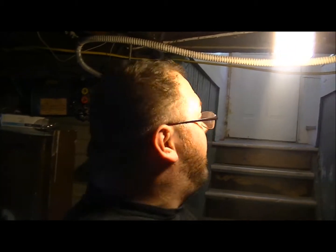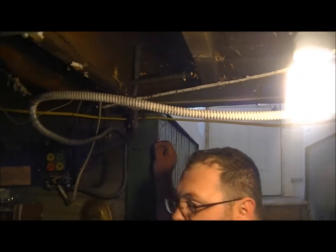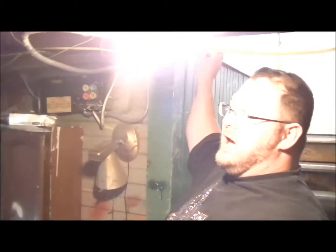Alright, wiring up this old house, been working on it for quite some time, should've got more video on if I did. But what we're doing right now is, I had a furnace issue after I left. The furnace was dying out, wasn't doing very good, it was still on the old wire. So before class, I hurried down here, ran this wire from an independent breaker to the furnace and got it its own power, so it no longer had the power feed problem that I was having.